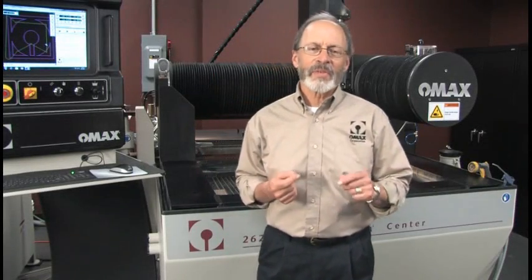There's a myth out there that the key to faster cutting in abrasive water jet applications is higher and higher pressure, but that myth simply is not true. The key to faster cutting is power at the nozzle. For example, a 60,000 PSI OMAX direct drive pump operating at the same pump power and the same abrasive flow rate can cut faster than a hydraulic intensifier operating at 90,000 PSI, and I'm going to show you why.